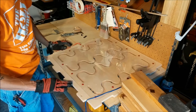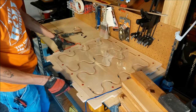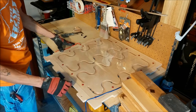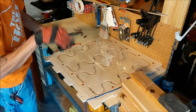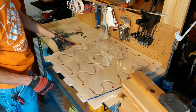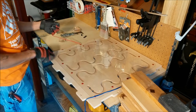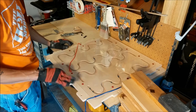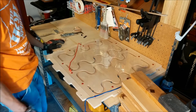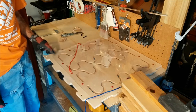Now I've got it all to where everything loose is off of there — nothing splintery. Now I'm going back with the grain with an 80-grit, which is going to smooth out and round over this edge, get rid of some of that black left from the used sanding sponge, and get rid of the cross-grain marks. After that I'm going to fix the other items — the magnets and this plug — before I put any finish on, so it'll all be done, set aside to dry, and ready for her to pick up.